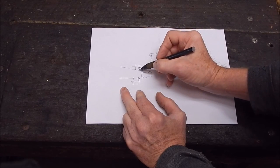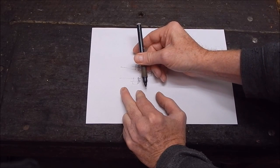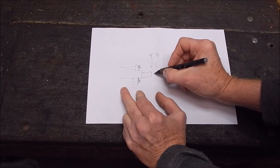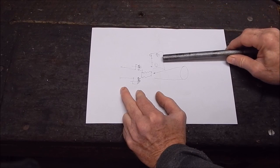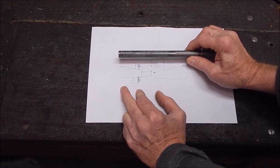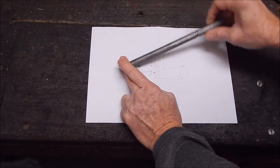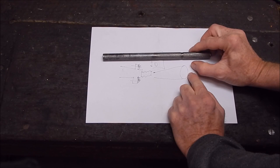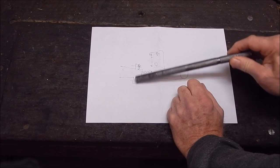So basically, if that is not perfectly vertical, if you get a swashplate effect, if it's canted in any direction, what will happen is that will make the chuck rotate in an oscillation and the job will transcribe a cone. So with a normal chuck error where the jaws are out of alignment, the job will go like this. But when you've got a register error, the job will go like this. It will go in a cone-shaped path, and you'll see that it's most evident if you put a very fine tip, like a dead center, into your chuck. You'll see the tip will oscillate. That's pretty much a dead giveaway that the first place to look is the spindle register.